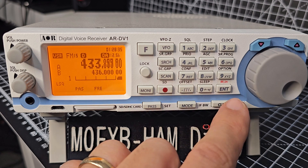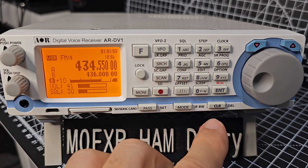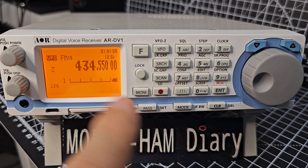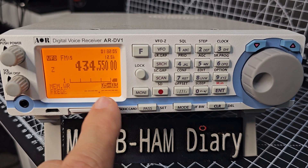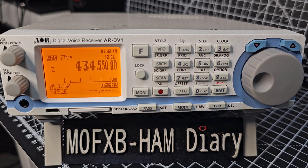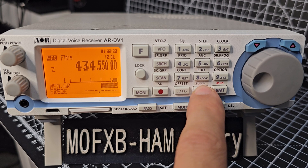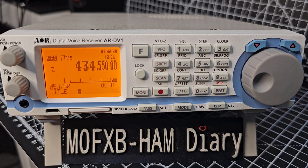Back to scanning by pressing clear. If you find something active, just press enter — it will stay on that frequency. Now you can hold it: hold the enter button and you can save it. You're choosing where you're going to save it. See here it says memory write 0503 — you're choosing which bank and which channel number. So 05 is bank 5, channel number is 03. You can leave it default or change it by typing — for example, type 0607 and you're putting it in bank 6 channel number 7.